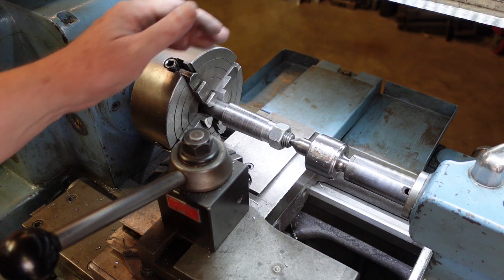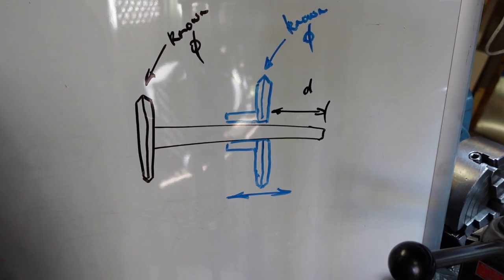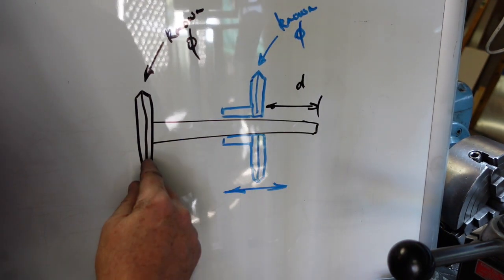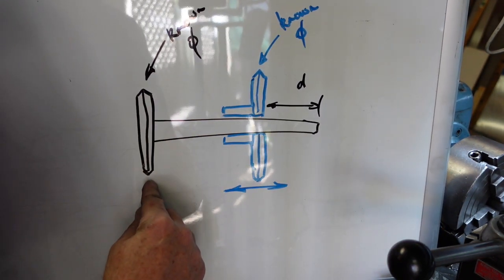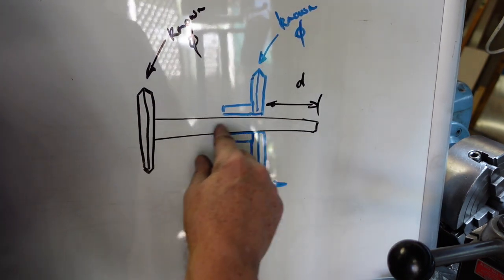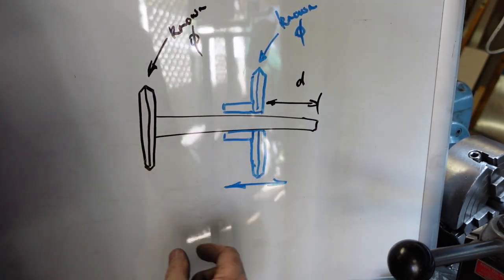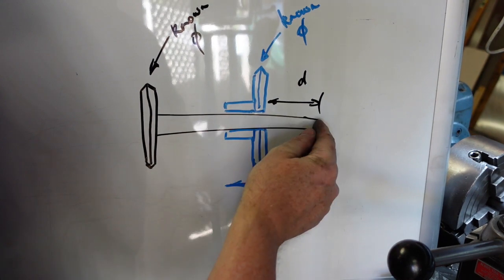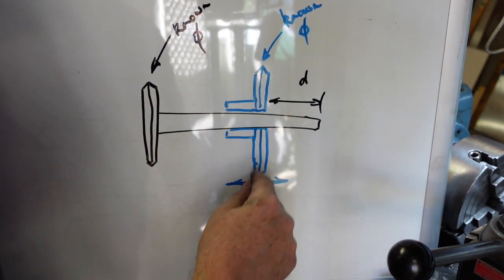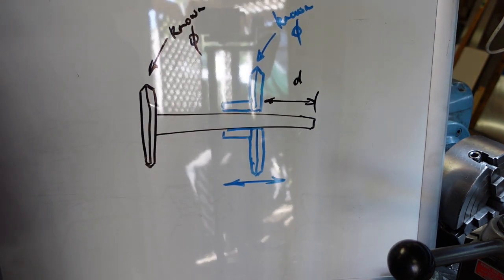The M5 to M3 is going to be a little bit trickier. What I'm going to have to do for that is make up a measuring jig, and it'll probably be something similar like this. So a disc with basically a knife edge, sharp edge there of a known diameter, sliding in another disc of slightly larger size, try that in the spindle, measure that distance, and then because I know what the distance from there to there is, I can take that away and work out what the taper is over those diameters. So that's how I'll have to do that, and that's a story for another day.